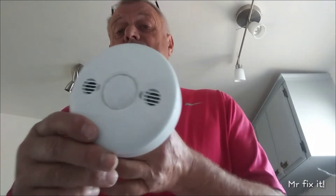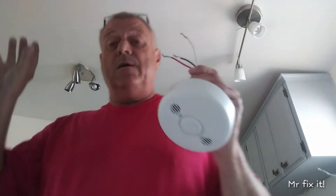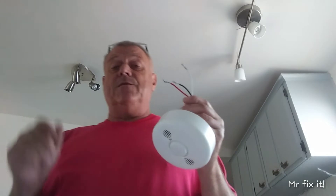This is the unit right here — it looks like a fire alarm, a smoke detector. So it's going to need its own box, and you're going to have to put the box in — you may have to hire a professional. Put it away from the doorways because it's very sensitive and it picks up movement in the other room if you have it by a doorway. Put it away from the doorway in the hallway, in between doorways. When I come out of the room — pop — this thing's going to sense me and turn the light on.